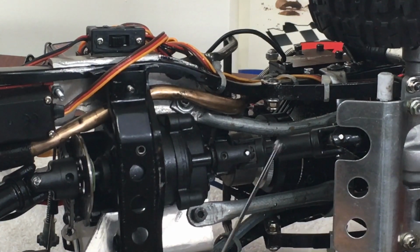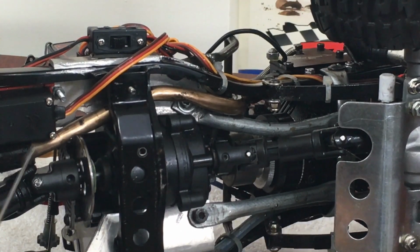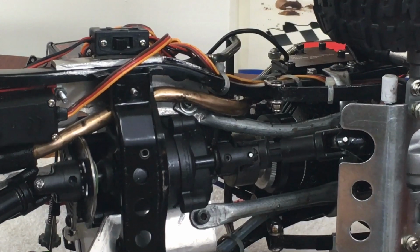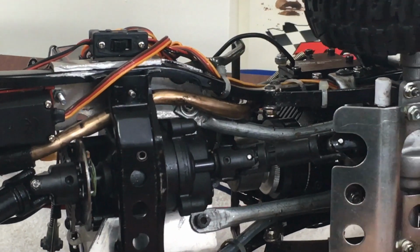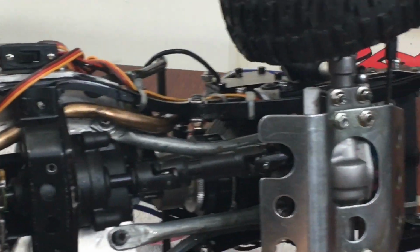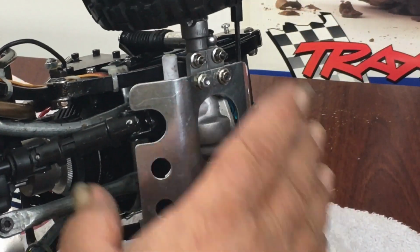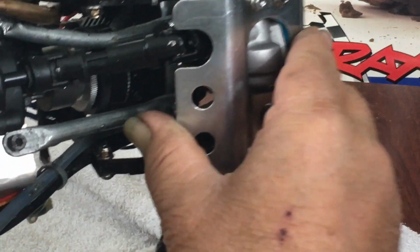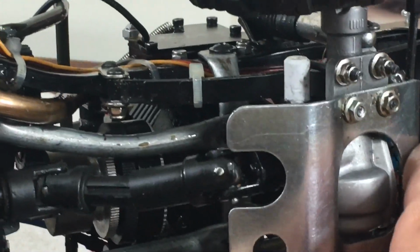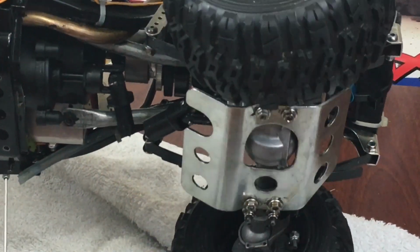And when you set it in straight, it brings the drive shaft over here. And the problem with these trucks, if you've ever noticed, your front drive shaft's really short on these things. And the reason is, when you collapse the suspension, you see it moves back. And then under hard acceleration, when you're really jamming on this thing, the rear end pulls forward. If you can look in the drive shaft there, you see it'll pull out, and it does that. So I'm working on that right now as we speak.